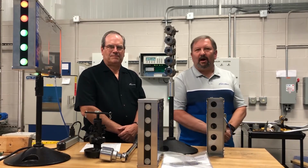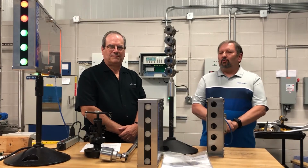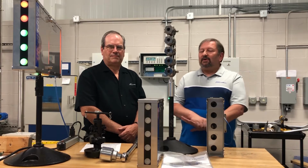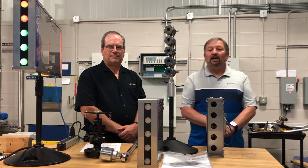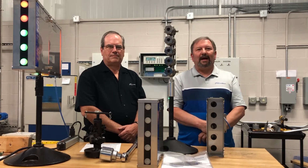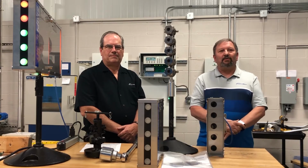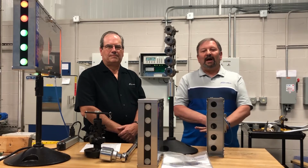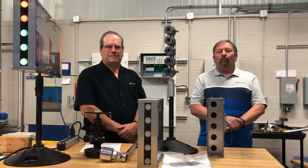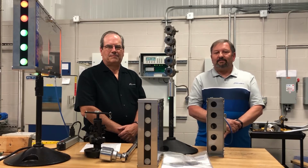We're here today to talk about the best way to properly commission your Simpliport gauge glass. But before we start, just a note of caution. Before you start, make sure to follow any and all plant lockout and tagout procedures that are required. Any trips or alarms should be bypassed to prevent any false trips or alarms when servicing or commissioning the equipment.